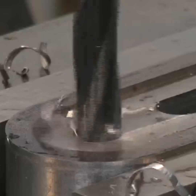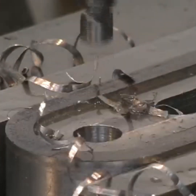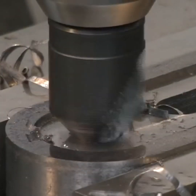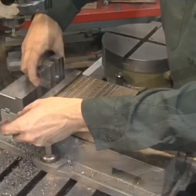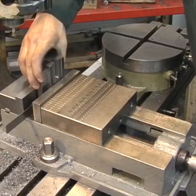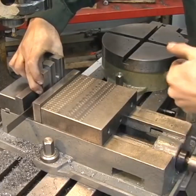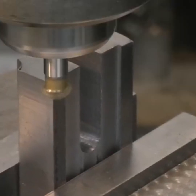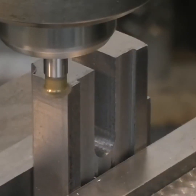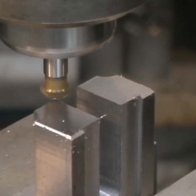Flip the part over and counterbore for the fastener. Then we add just a little more craftsmanship with a chamfer. I stand the part up on end so we can deburr and chamfer the details on the backside. I use a machinist square to put it in the vise, then use the chamfering tool — all done by eye, just moving the table back and forth until it looks about right.